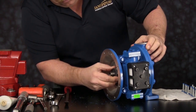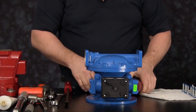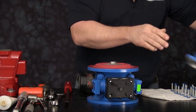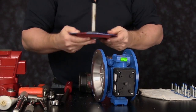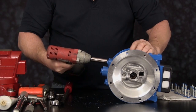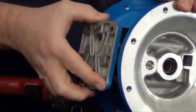Remove the diaphragm bumper from the diaphragm rod. Roll the unit up on its side again, removing eight cap screws to remove the opposite outer chamber. Once the chamber is removed, we can now push the diaphragm rod through the intermediate assembly and remove the second diaphragm assembly. We now want to remove the air inlet cap, gaskets, pilot valve, and pilot valve gasket.